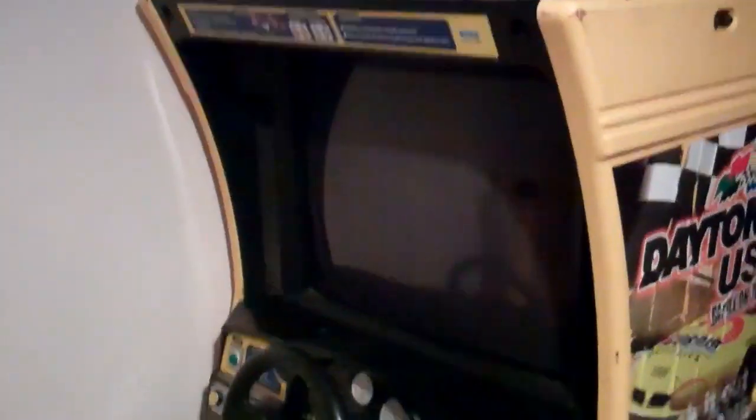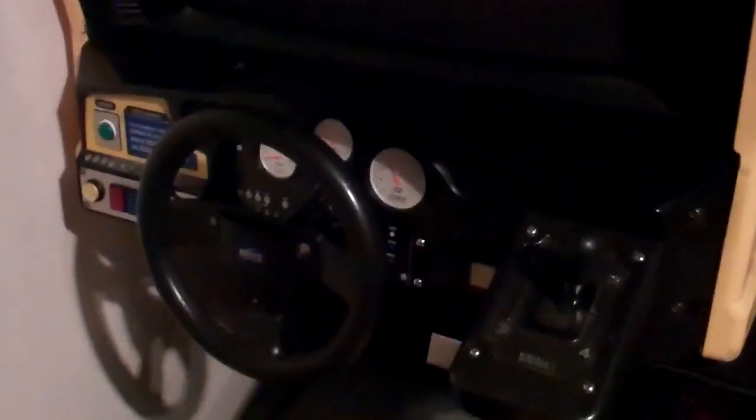which is really awesome, because that actually features force feedback, which I can use because I've got a little adapter made by a French fellow. I can't remember his name. Agianti? So it sounds like that anyway. But yeah, it's behind here, and basically it sits between the original Daytona feedback motor that's in there, and the Logitech board, which is actually under the seat here. What it does is translate the feedback effects from the Logitech board to the original Daytona motor, and it's strong. Let me tell you, it really is powerful, and it works so well. But yeah, I'll show you that in due course.